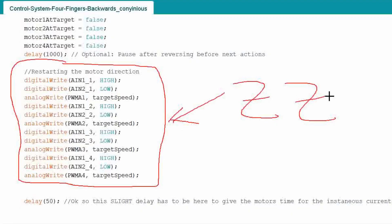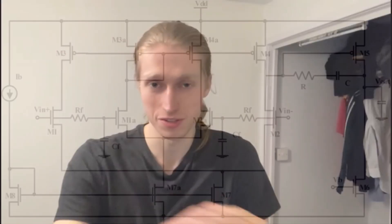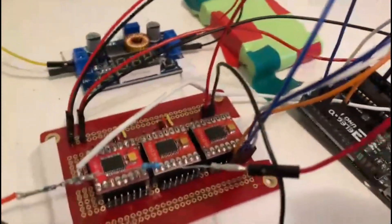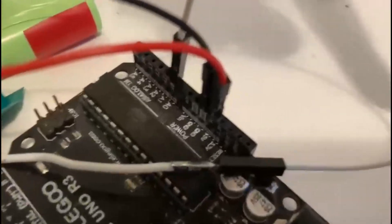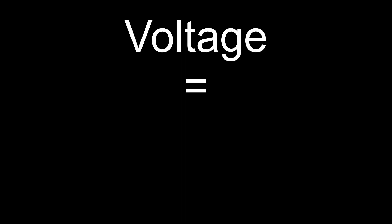To flip the motor direction, we flip the polarity of the motor in software. Now officially, because of that, to get current sensing working you need an op-amp. But that's loads of additional circuitry, and this is what the ugly ass circuits tend to look like. So I'm gonna do it my way with this abomination. We've got a red wire going into the motor where the current we want to measure goes, and a white analog wire that goes straight into the Arduino that is measuring the current across that resistor, because V equals IR.